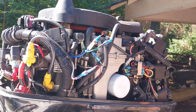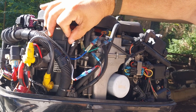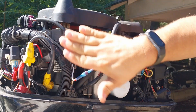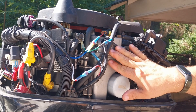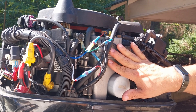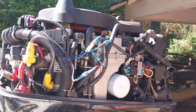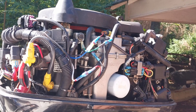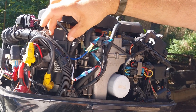What we're looking at here today is I've added this relay zip-tied right in here with this wiring, nice and compact to the motor. I've read on a few different posts that when you put an aftermarket fuel pump in these Mercury engines like this, they have a tendency to burn up the circuit that's in the computer. I didn't have any problems so far, but figured better safe than sorry, so I cut the wires that went to the actual fuel pump.